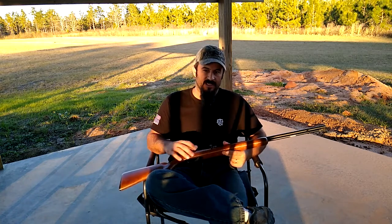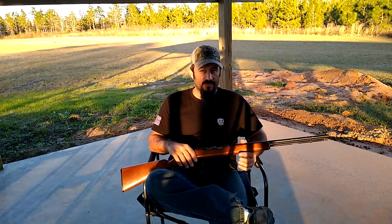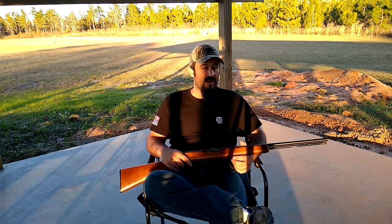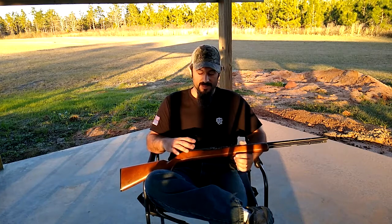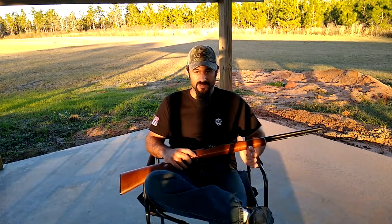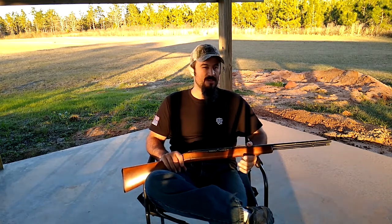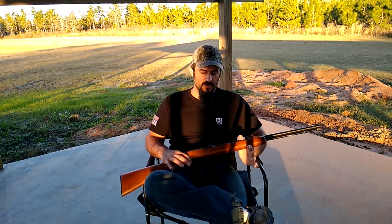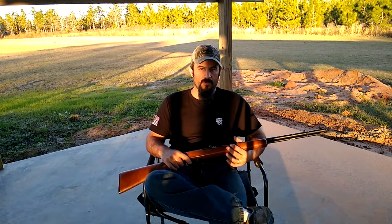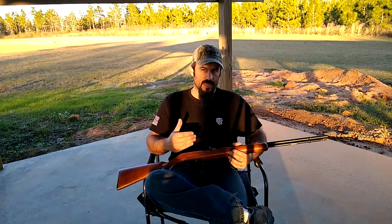As gunsmiths, you need to be very keenly aware of what is going on and how to diagnose each system. Function checks can tell you a lot about a gun, but there's also a lot they can't tell you. Specifically, they're not going to tell you how the gun actually functions — just that the fire control group is working properly, which in this case it doesn't seem to be. So how else do you check the function of a firearm? A test fire would tell us what's going on, and we can narrow down the problem. There's something called a cycle of operations that occurs in a firearm.